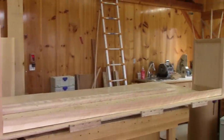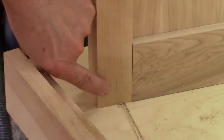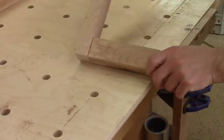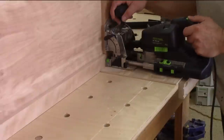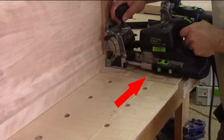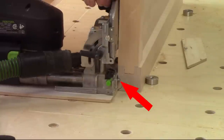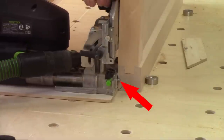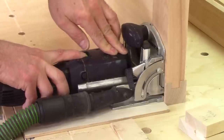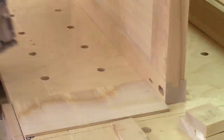Here's an idea of the size of this bookcase. I have to do the joinery now. Everything will be held together with dominoes, and here's the test piece I've used. All the references are done with the base of the domino mortiser, and for the frame I lift it a bit. I also use the aligning tabs. The eight mortises are done, but on the lower stretcher I want two dominoes, done with six millimeter mortises.